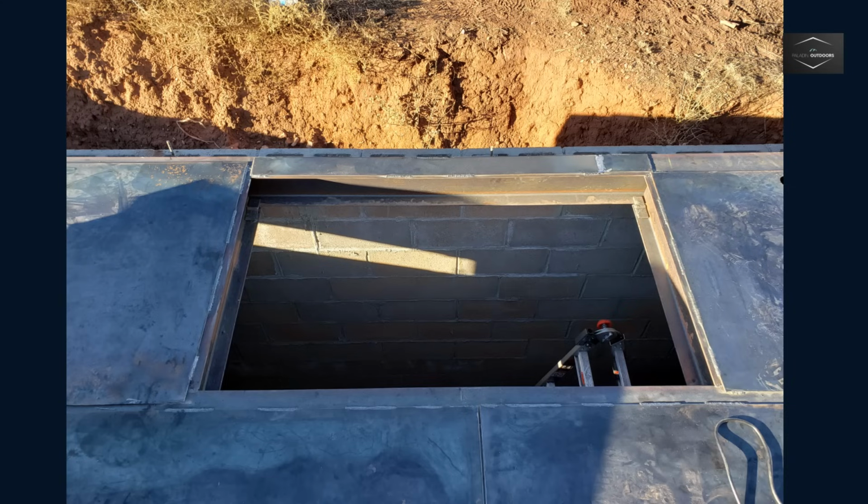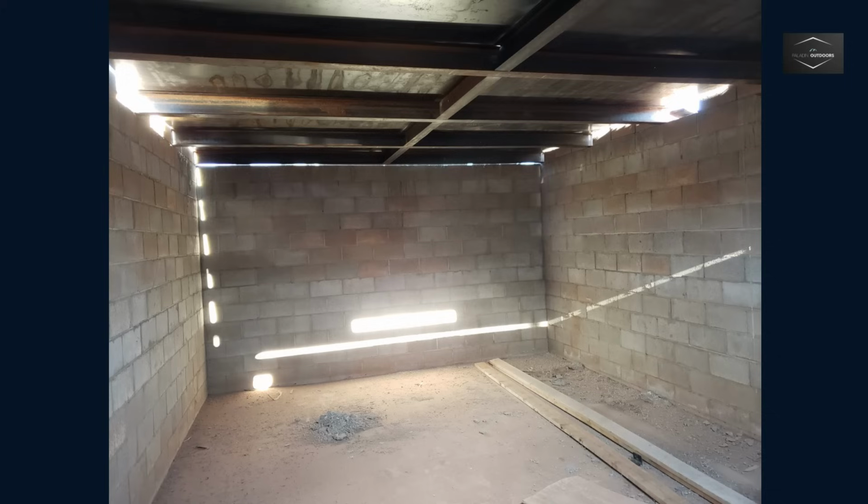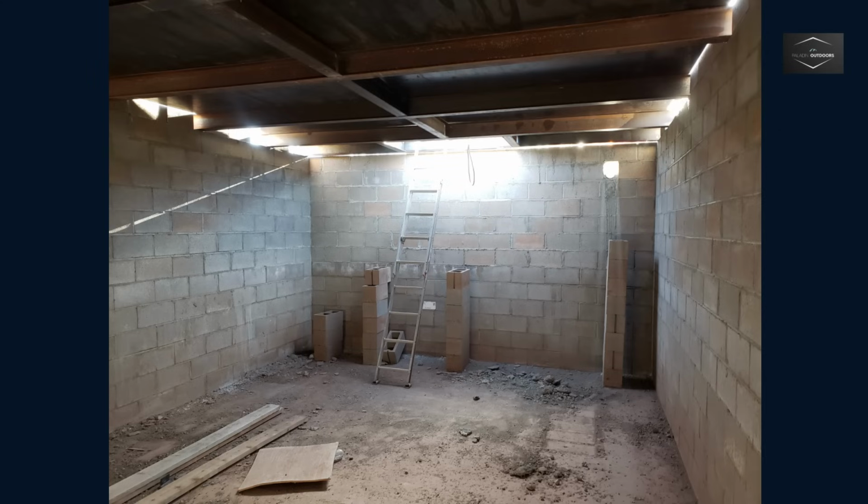With the steel plate welded, it was time to install an access hatch. I went with the largest prefabricated roof hatch I could find. Looking back, it would have been better to use a floor hatch, but the best option would be to craft one due to the exorbitant cost of prefabricated units. Welding the hatch's thin metal to the thick steel plate was a new challenge. Next, I placed additional welds underneath the steel plate to further secure it.